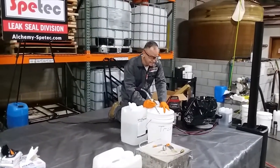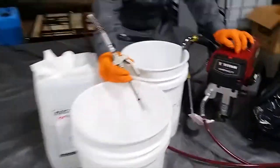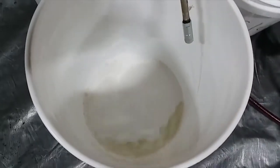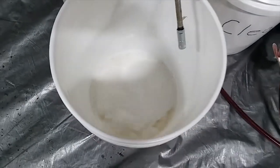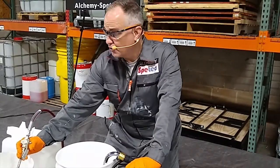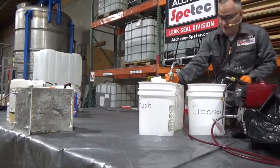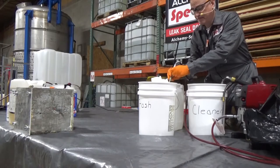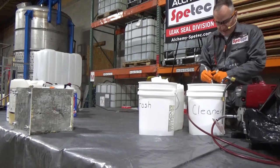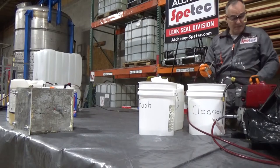I'm shooting to the side so we don't splash. You can see the cleaner is clear — the cleaner with oil looks like it has some oil in there. Neither oil nor cleaner will react with our product to set it off. But we don't want to pump oil into our grout, so we make sure we're nice and clear. I'll recirc just a little bit — just nice cleaner. If I still saw oil, I'd flush some more. My pump is primed.